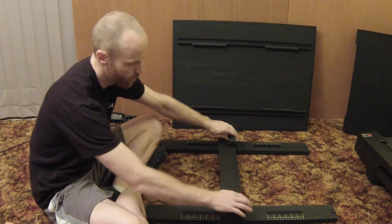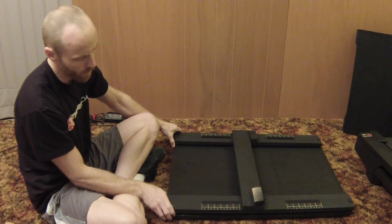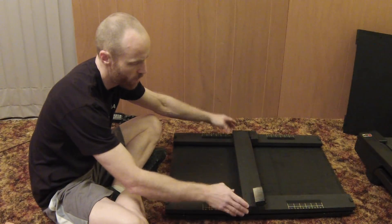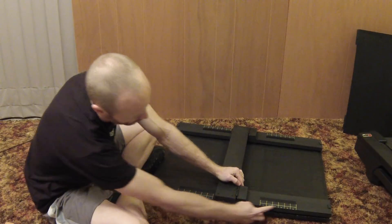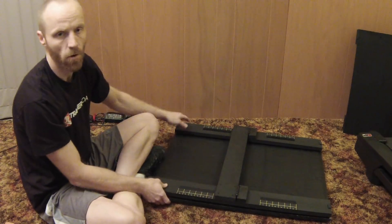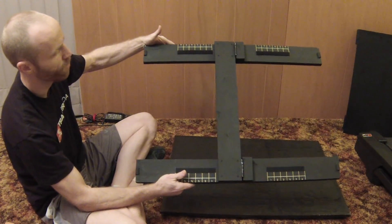With the center bridge piece, hinges, and the two foot pieces, join everything together. The deck you've already made is the same size as the spacing you want, so lay out the two feet flush on all ends — 32-inch width and 24-inch front to back. Lay the bridge centered, and position the hinge itself dead center on that 32-inch width, about 16 inches in with a sixteenth of an inch offset. Pre-drill and screw the bridge to the feet to create the I-shaped base structure.